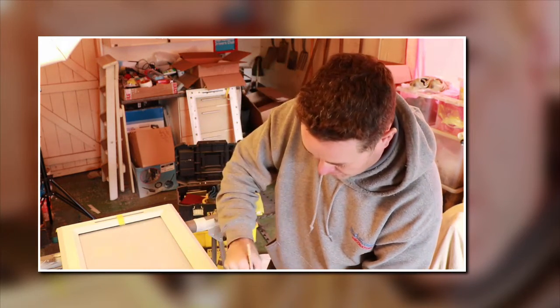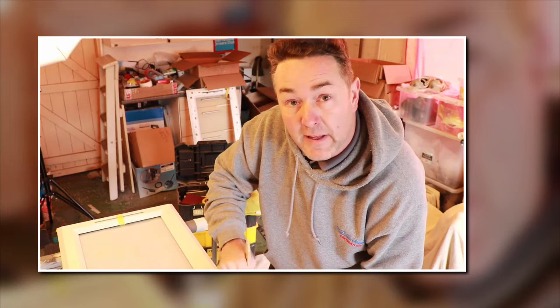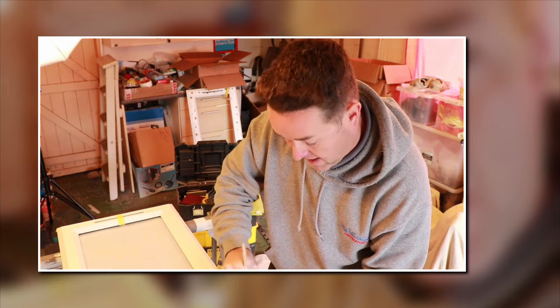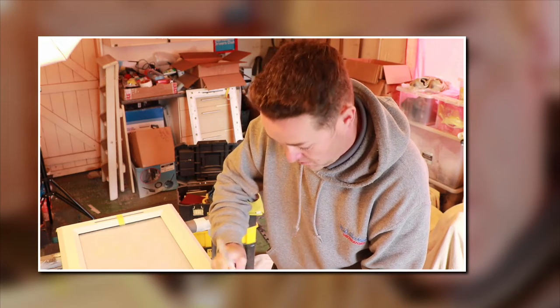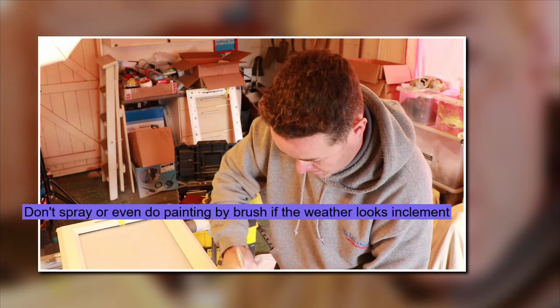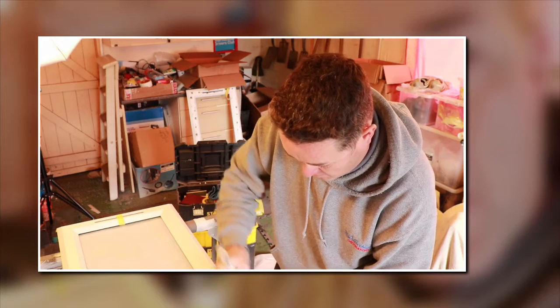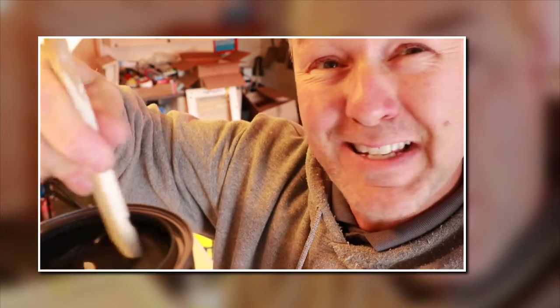Proper anthracite colour - I'm going to give it a nice wind up. Now I'm at room temperature but I'm outside because I'm in the garage. Don't forget, paint can be very temperature dependent. Watch your weather forecast - don't do any spraying in cold weather, and likewise if it's too hot it might not do you any favours. That's nicely wound up - I've gone down the sides, mixed it up properly, scraped it down the sides to get it all into the corners. Look at how that flows.